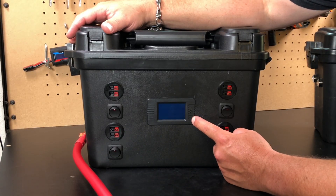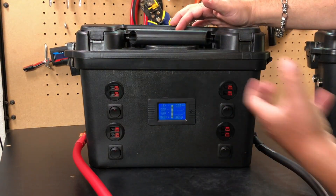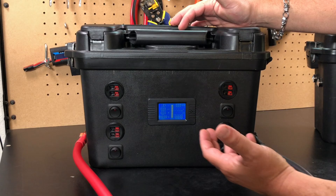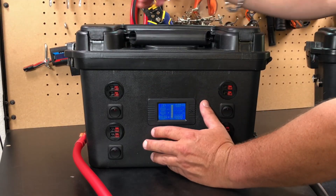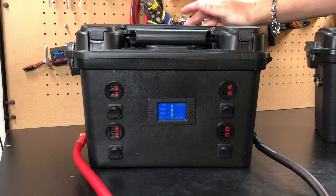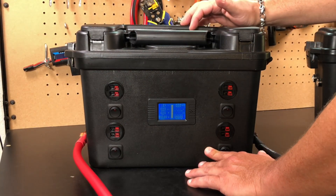Now this is connected to the expansion pack. This is our battery gauge — we can turn that on and we see we have power. We're at 13.4 volts. I set the high and the low. When it starts drawing current we'll see our current draw; it will accumulate our current draw over time as well as show real-time current draw, watts, watt-hours, and battery resistance. These meters are great. I stuck with the 100-amp shunt for this. I bought a 300-amp shunt with the same meter for a bigger project coming down the line. But for Field Day this is all I need — I don't really expect drawing more than about 80 amps out of this, but 100 is fine.